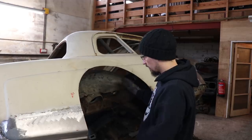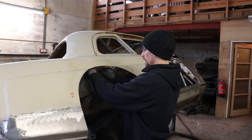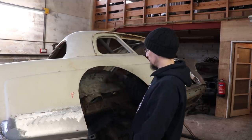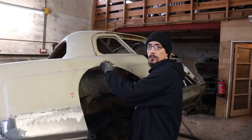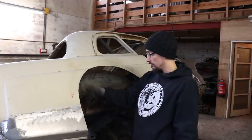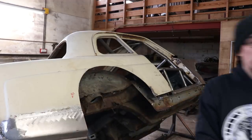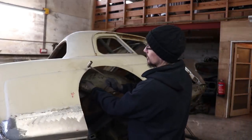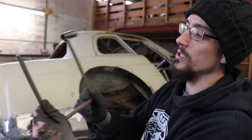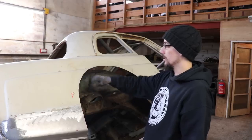I need to clean all this up and then trim it off so that it's dead straight, and then I'm going to try and just bend it about and reshape it to get more of a curve similar to what we've already got here. Trim this to match that, and then we're going to fold this edge, put a lip on it so you'll have a little lip facing outwards, and then we'll just have a flat piece of steel that we can spot weld on the outside. A couple of stitch welds on here. So pretty straightforward — just cut this off and then use this. You just stick a pen through there and then you can transfer the inner arch to the outer arch. Precision instrument, copyrighted to ArchVab. This is how we do it on the Escort rally cars when you want to tub the arches.